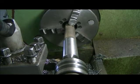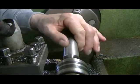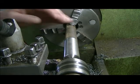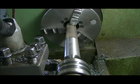Sometimes it works, sometimes it doesn't. 20/1000 is quite a bit, but the spline's very hard, so it should cut its own slice in there, and I think everything will fit just fine. We'll just take her down a bit here and we'll show you what's happening.